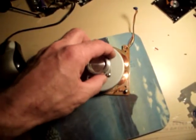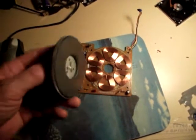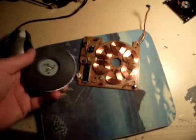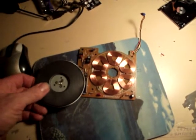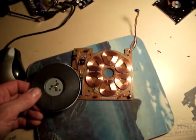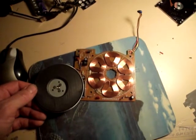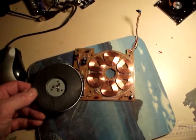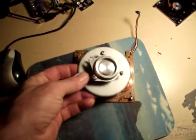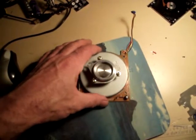Now, here's the other thing. This little unit at 12 volts is probably going to have to spin incredibly fast. Like when you put 12 volts to it as a motor, it's probably very fast. So if you're spinning this with the wind, you're probably going to get a very, very minimum voltage and current, because you're not spinning it at its engineered speed.